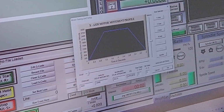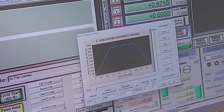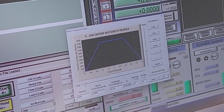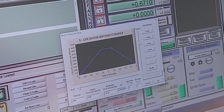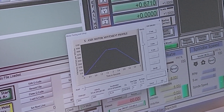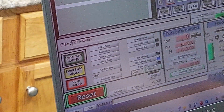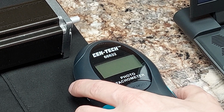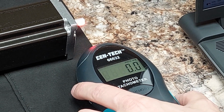Let's see. We do not adjust micro stepping, we'll leave it at 10 times, providing 2,000. Acceleration, once again, at 35. And we'll click on Save Axis. See how everything has basically been readjusted. We'll click OK and begin the jog. Once again, we hear the tone difference.